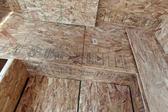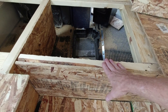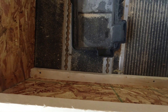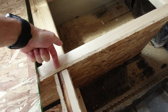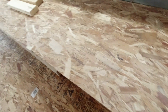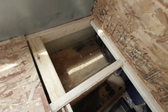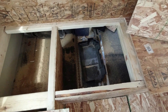Back here, the very first thing I did was make this little wall here, and it's made the same way — 13 inches tall OSB with a two-by-two at the top and another one at the bottom. Then I do the sides and connect this through to this, so those are all one piece. This piece obviously runs down the length of my seats, which makes it very sturdy. If you've ever experienced building a waterbed, that's kind of where I got the idea for this.